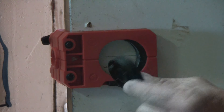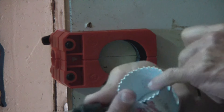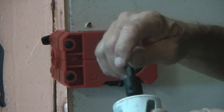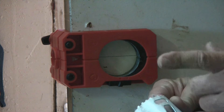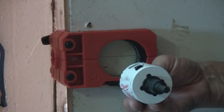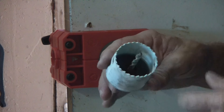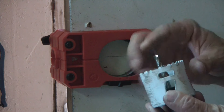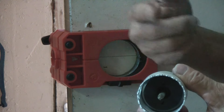Before I drill the hole out, I'm going to tell you about the little depth stop I didn't mention earlier. Let's assemble this in preparation for the hole. You have your hole saw — this is the two and an eighth. Put the washer, put your adapter on, take the arbor and screw that in. Now this is the depth stop insert — simply drop it in. It prevents the hole saw from going all the way through. This is a very aggressive hole saw — it'll chip it up. If it blows out the backside, it's going to splinter the door beyond repair. That little stop prevents us from going all the way through — it stops it. But the hole will go all the way through. So what you do: once you hit the bottom, take the saw out, go to the other side, put this drill bit in the hole it made, and continue on that side. That way you don't have blowout.